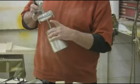Now, side note, if you're doing a mahogany or a pine or walnut or something that's a softer wood, then make sure you use a hardwood peg. I think I wrote in the forum that if I'm doing mahogany, I use cherry. And that does well. If I'm doing walnut, I just go ahead and use walnut. Now, here's the thing with the peg. I also made a comment that if you peg yours, make sure you put a clamp across this when you're driving the peg.